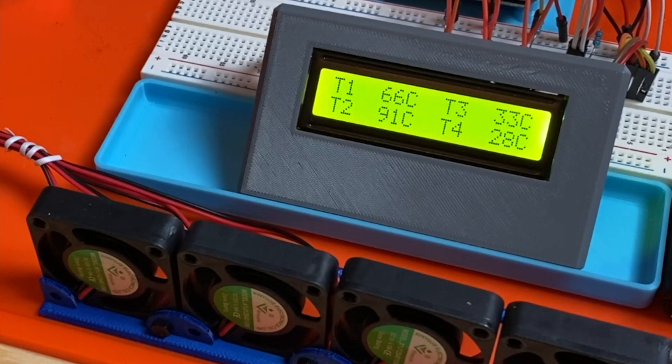Wow, that's eye-opening. The 7812 with a heatsink is over 60 degrees C, and the 7812 without a heatsink is over 90 degrees C. Those are both really hot. Meanwhile, the two buck converters stayed below the body temperature of your average human. The larger one was a little warmer than the smaller one.